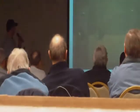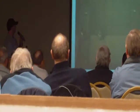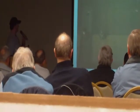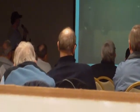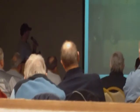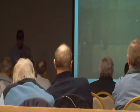One failure I had to turn into not a failure — quick thinking. This is the subfloor, first level, in the basement. Here's one of the connecting rafters going across to the floor. This is from the first bracket — I wanted it to be down here below the level and then have a plate over it. Measure twice, cut once, or drill once — it's right on the edge. So I had to add a sister board in here and do the best I could. I've since put in a metal bracket covering both. I showed the good, the bad, and the ugly — just throwing it out there. Always double check.